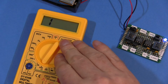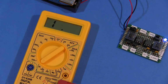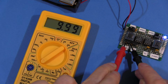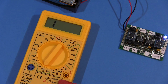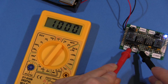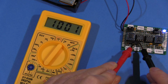And let's check out the €4.50 meter. Now, according to the bits of paper that came with it, this one should be slightly worse, according to the specs. Let's find out. And so we want to start on the 10k range, 10k ohms. 10k, there it is. You saw it, 9.99. 10k. And the 1k ohms range. 1.0010. 1.000. I mean, that's within, you know, this blobber solder here. Let me touch it in a different place. 1.001.